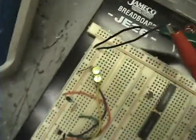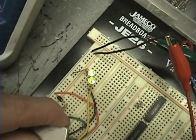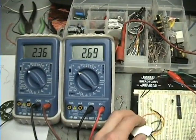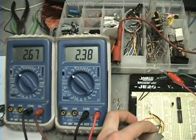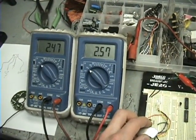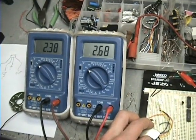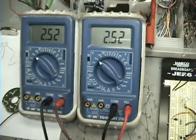With no magnet, you can see one LED is bright and the other is dim, and they change with polarity — north pole, south pole, see how they change. The voltage also varies as you get close: as you get closer and closer, you can see it climb as the field gets stronger. What I'd like to do is put some sort of digital voltage converter so I can turn on LEDs in a pattern, to actually see how strong the magnetic field really is. I'm going to have to build and design the rest on my own.